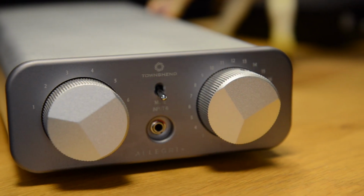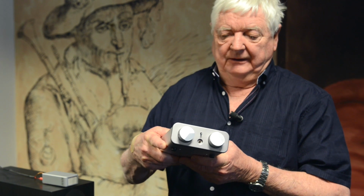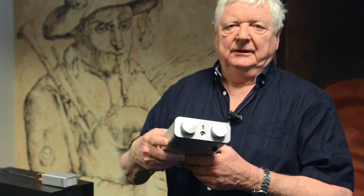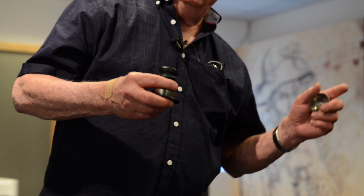It's very, very simple. It's based on an auto transformer design, and it's been compared with preamps costing up to, well, hundreds of thousands of euros, and it's still a clear winner. All it does is attenuate. Whereas with this transformer technology, you don't have the problem of the resistive potentiometer and the impedance problem of resistor ladders, because all the transformer equations are working on your side. And it just is absolutely quiet, very, very low distortion, and it works. And that's the ALLEGRI preamp.